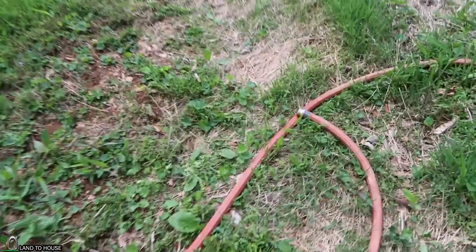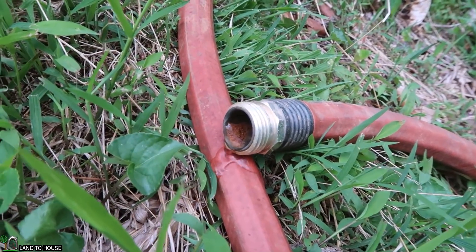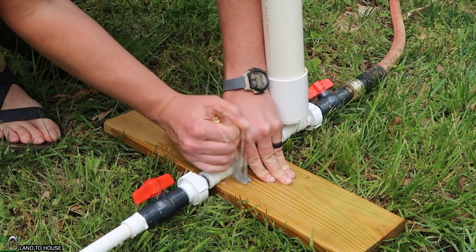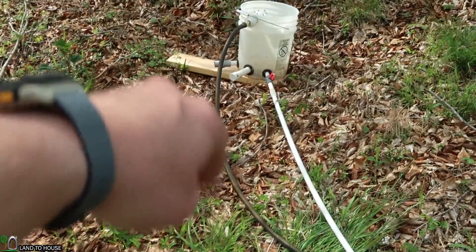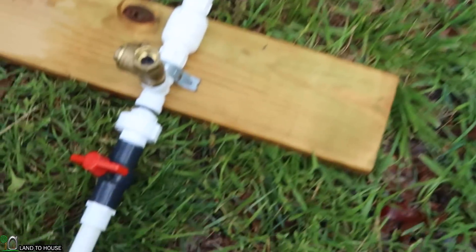It's quite comical. About 45 minutes to get this kind of flow rate here. Just a little trickle. So let's increase the amount of head pressure by about 6 inches or so. And we'll turn the valve upright hopefully. That right there should be significantly improved at this height. Let me add a little bit more lift on that head pressure. The bucket was right here and now it is right there. So that's a lift of about a foot. And let's see if that makes much of a difference down here at the pump. I anticipate that it will operate now with regular valve placement.